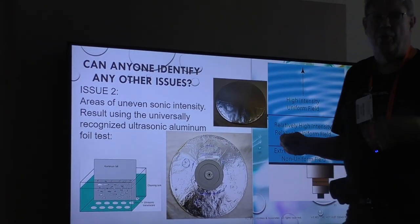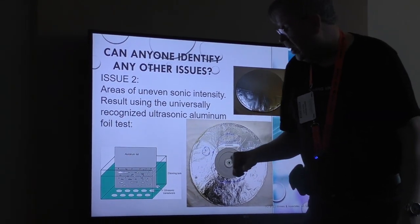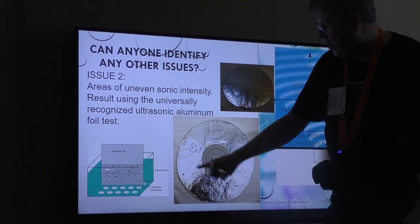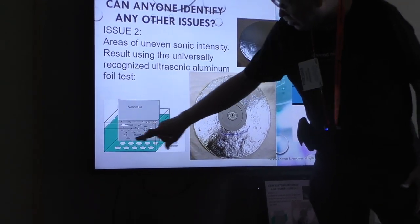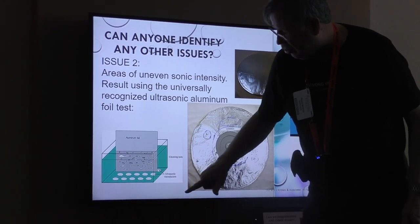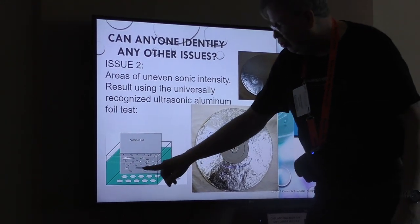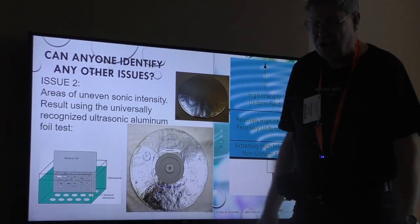So here, this is the standard aluminum foil test that we were talking about with everybody, Mr. Fremmer included, where when I worked on the space shuttle in 1978, our baths were 6 foot long, 4 foot wide, 4 foot tall, and twice a day we had aluminum foil on the frame go in to take a look at the dimpling. We needed dimpling because we had hundreds, or 30, in our case, 38 or so transducers, and twice a day we have to make sure for spacecraft that all transducers are working per NASA law or regulations to make sure that the spacecraft materials we worked on are cleaned. If we had a transducer that did not dimple the aluminum foil, we now have a problem and we'd have to redo that production of the day.